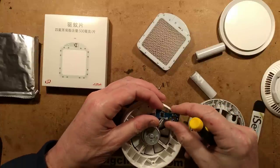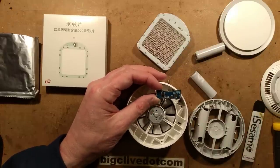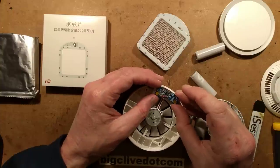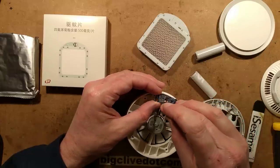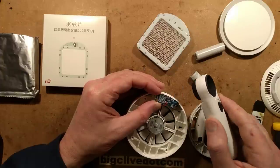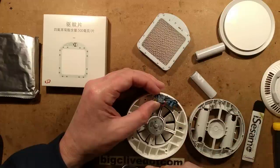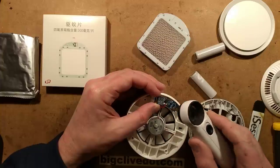Oh, look at that — it's a little eight-pin chip. I wonder what that is. Could that be the ubiquitous eight-pin chip? Let's see if there's a number on it. There's no number. That could be one of those ones that Dave at EEVblog was investigating recently. There are a few contact pads which may be for a programmer or testing, a smattering of components, and then there's one transistor which I'm guessing is ultimately switching the fan.